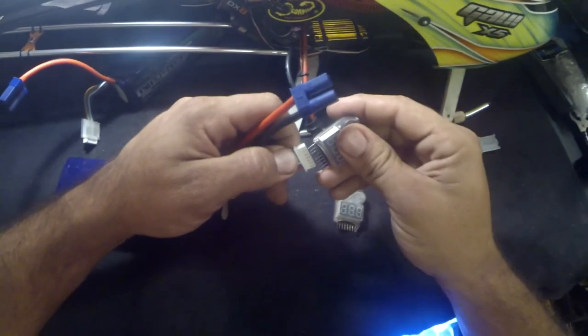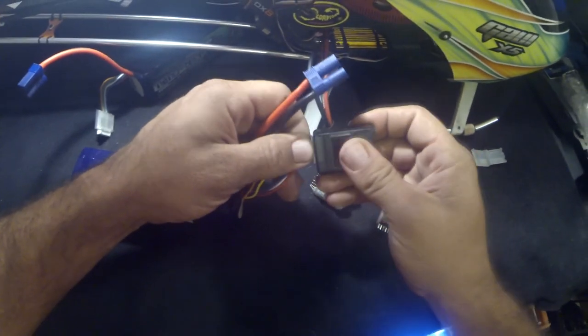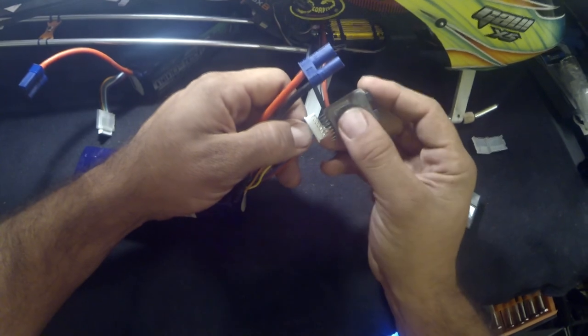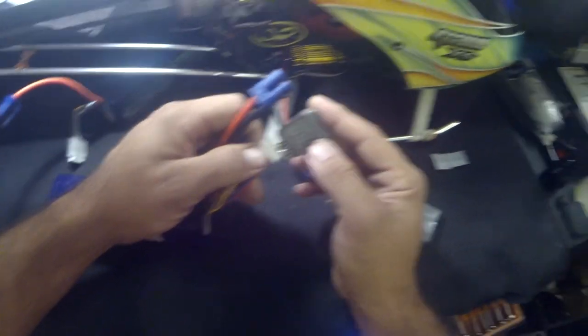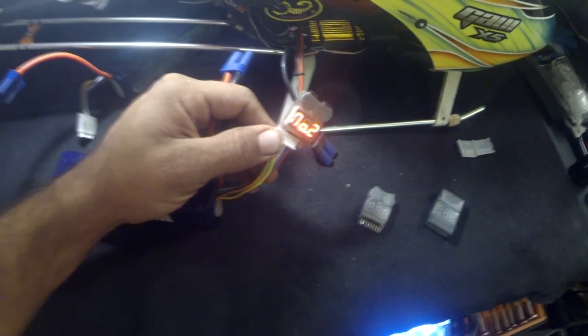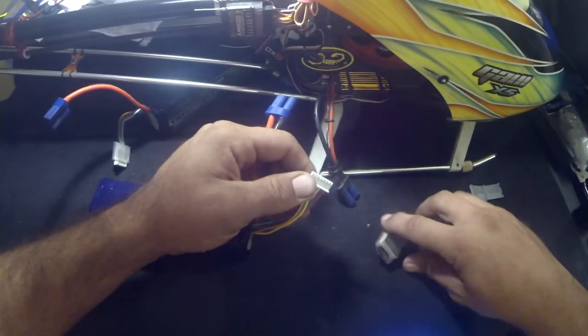And I can show you all 3, which is just kind of a pointless waste of time, but just so nobody can say, well, your meter was broken. But all 3 meters. And if I go over 1 pin, I won't get a reading on all 6 cells, but if I go over 1 pin, I'll get a reading on cells 2 through 6, which all show basically full, 3.8 volts each. Not full, but 3.8 volts each. And so the first cell indicates to me has gone bad.